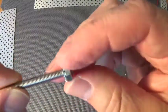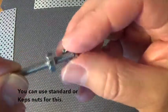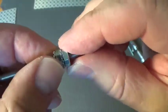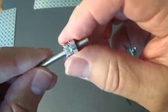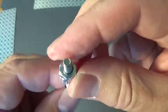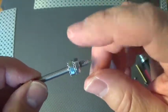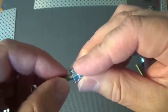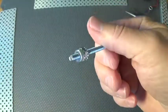There is a technique called a jam nut. You get two nuts together and take a wrench and rotate them in opposite directions — they'll jam into place. That's a way to keep a standard nut or a loose Keps nut from getting loose, sometimes when you're desperate and you don't have a Nylock. I don't recommend doing this very much because it does put a little bit of stress on the threads and can damage them, but it is something you can do if you're desperate.